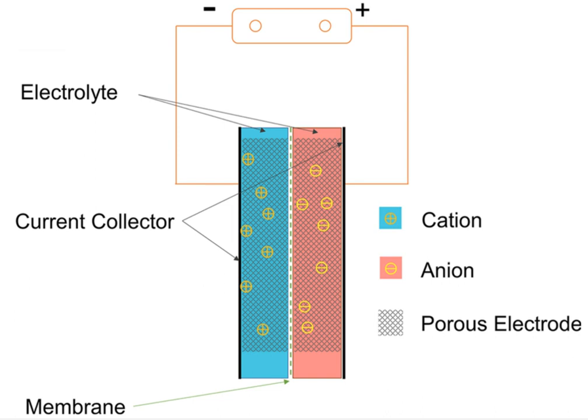Even in 1970, the electrochemical capacitor patented by Donald L. Booz was registered as an electrolytic capacitor with activated carbon electrodes. Early electrochemical capacitors used two aluminum foils covered with activated carbon, the electrodes, which were soaked in an electrolyte and separated by a thin porous insulator. This design gave a capacitor with a capacitance on the order of 1 farad, significantly higher than electrolytic capacitors of the same dimensions. This basic mechanical design remains the basis of most electrochemical capacitors.